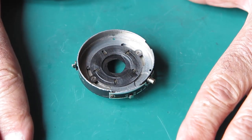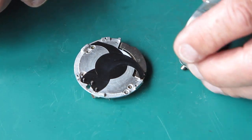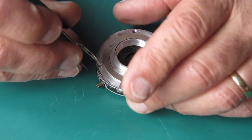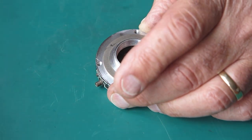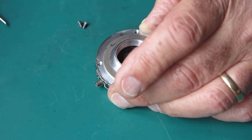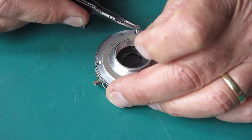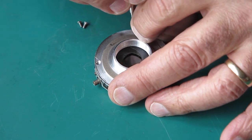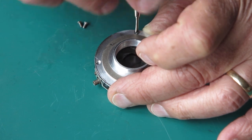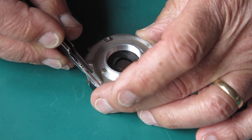The mechanism plate I have cleaned, fitted the shutter blades as I said, and this should all go together now with a minimum of fuss - at least that's the theory. Line up the three screw holes. There were three screws, and one of them was longer than the other. The long screw was not the one with the X mark next to it - it was the one with the little tick mark that I'd made. See if we can run that in. I must say I haven't made much effort to make sure that is the appropriate place for that screw - I could certainly do that now.